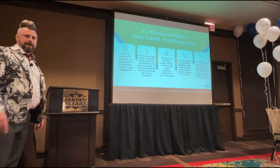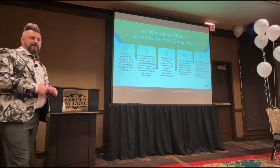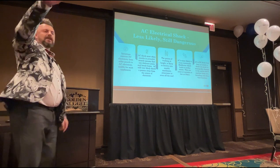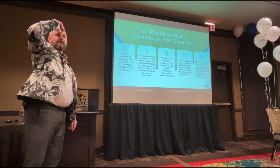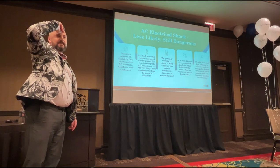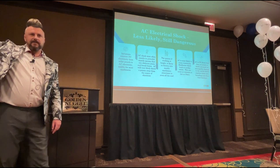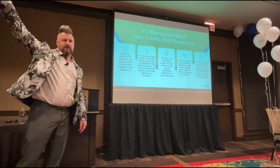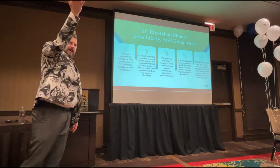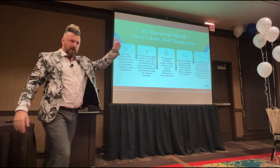The metal frames. Exposed overhead wires. Overhead cable's usually a DC. So that again is gonna give you a DC. What was your answer at the back, sir? The metal frames. So the metal frame that's attached to the solar panels, that's going to be DC side, isn't it? You're still working pre-inverter. So the solar panels up there are producing DC electricity. If there's a fault, that framework is going to be carrying DC electricity, okay? The only way you can get an AC is post-inverter.